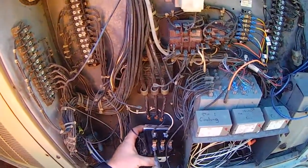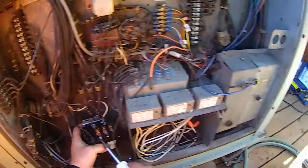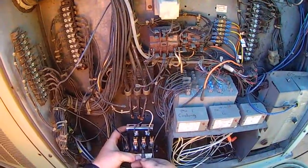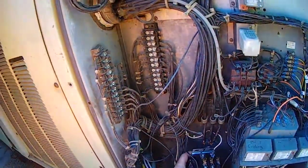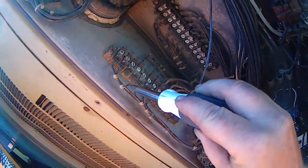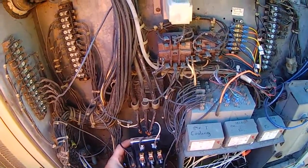Loosen up our terminals. While we're doing this you can see that things have been redone. These RIBs — relay in a box — have been added to the control system. We've got stage one, two, and three on this. Look at all the wires — they're the exact same color. So when you're tracing this out, you've got to rely on the terminal block, one through twelve, and each wire has its own number. Like here, this one has 209A. So you can look at your wiring schematic and figure out which wire goes where.